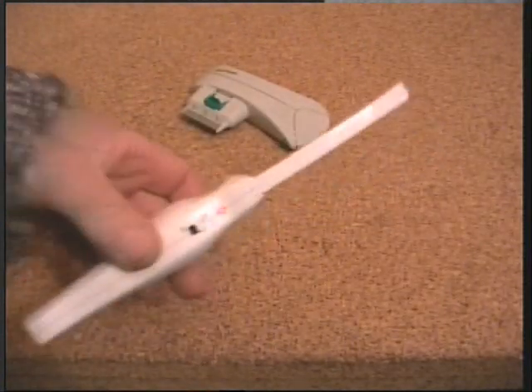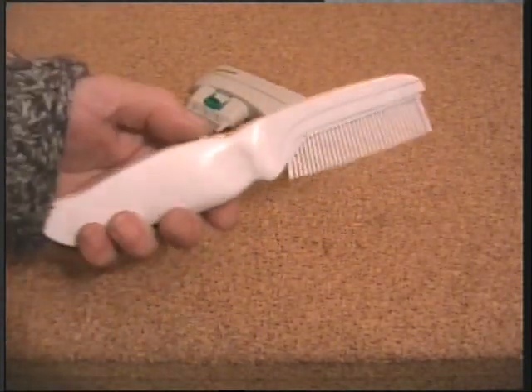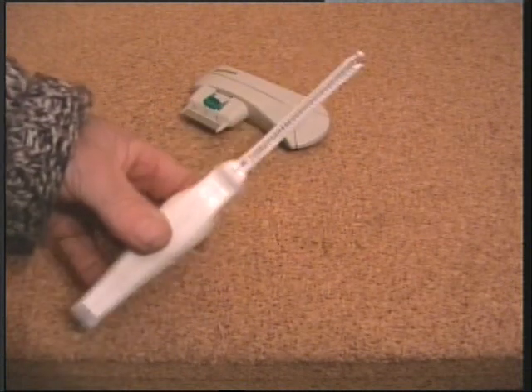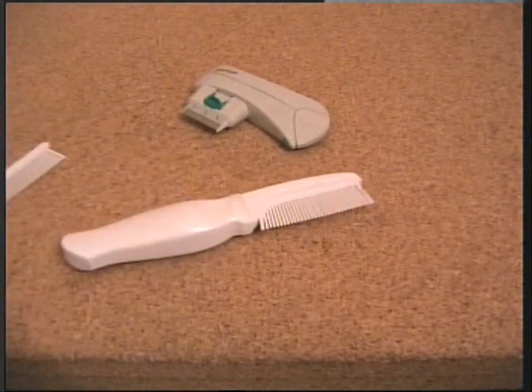I had it running for a minute and it's ticking away, and I could smell ozone. If we've got ozone, we've got arcing somewhere — we've obviously got some pretty potent voltages going on. Let me switch the lights off. Can you see the flashes? That's taking place all up and down the comb. So we've got quite a few thousand volts here.